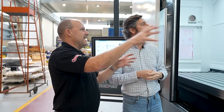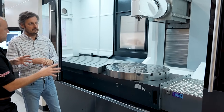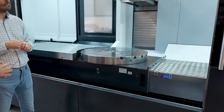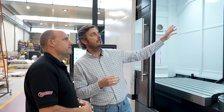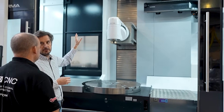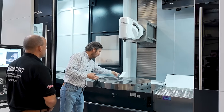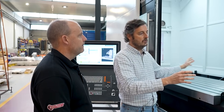When I look at the size of the machine and all these axes moving, how do you maintain tolerances across everything? You've got a lot of moving parts — the table moving, the ram coming in and out, the mechanical head. First of all, you need to align perfectly the three main axes of the machine. Then you need to align the head perfectly with respect to the machine axes. And finally, you align the spindle, which is parallel to the Z axis, perfectly with the rotation of the rotary table. In this way you can set the geometry of all the axes together between themselves.